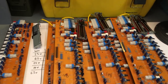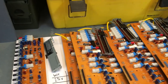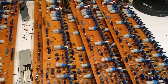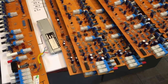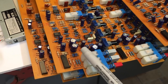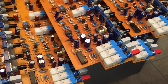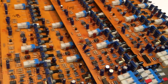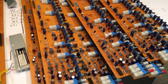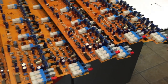I did go ahead and label them all so I can put them back into the same order. One of the big major things I'm going to be doing is replacing all these capacitors — some of them have bulged, which means they're bad or going bad, and it's really affecting the mic preamps. This is probably related to the modifications I made. I'm going to order close to a thousand capacitors.